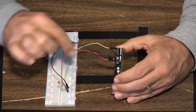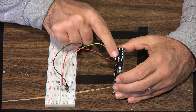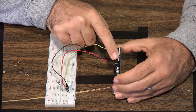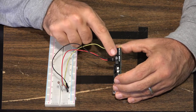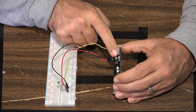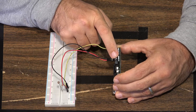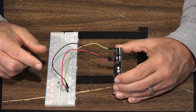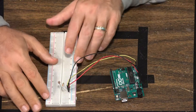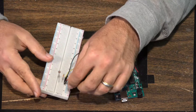Past that, we have the power wires. We have the VCC, and the power going into this photoresistor is at 5 volts. It is important to understand that I did play around with this and you can use 3.3 volts to power the sensor. The only difference is that since it's an analog sensor, you will get different value readings if you only give it 3.3 volts. So you can give it 3.3 volts or 5 volts, but if you're going to do if-else statements, the number you get with 3.3 volts is much smaller. Just decide whether you're going to use 5V or 3.3V and always use that. So here we have our VCC and our 5 volt going into the positive pin on this photoresistor sensor.